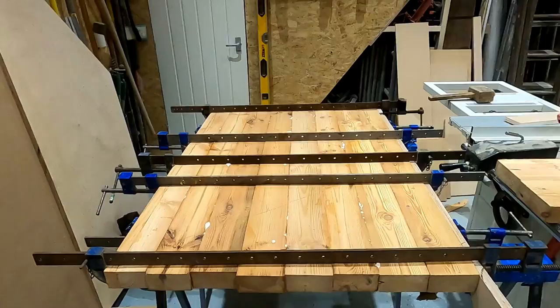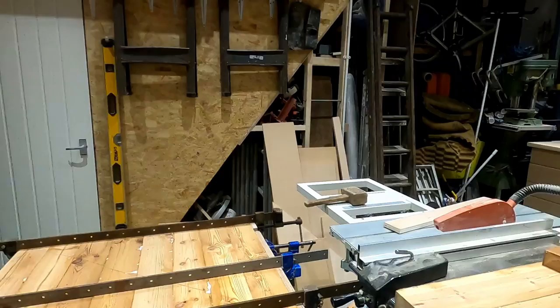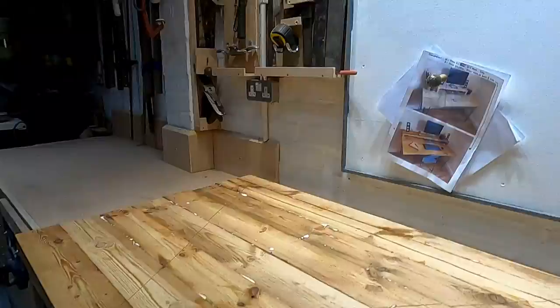It's the next morning now, so the glue's been drying all night — it's been a pretty cold night actually, but it seems to have gone off. I'm just about to take the clamps off. As you can see, when I put the clamps on last night, you always alternate the clamps — you want some underneath and some above. Otherwise, if you just put them all above, it tends to make the wood bow because all the pressure goes into the middle. If you alternate the clamps, it tends to keep it a lot more stable. It's out of the clamps now and it's stayed in one bit, which is always a good sign.